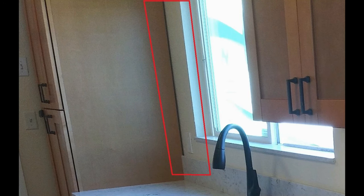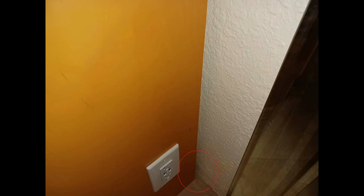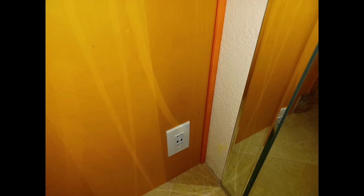Now to address the gaps on the east wall. Since this wall isn't straight and flush, the resulting gaps — which vary from half an inch to three-quarters of an inch wide — need some backing to support the molding strips. So I took some narrow strips of half-inch thick plywood scraps and used hot glue to mount them directly on the wall just below the surface of the cabinet edges. Then the molding strips were cut to length and held in place with hot glue as well. A big advantage of hot glue is how quickly it sets, so you don't have to hold it in place for very long, and mistakes typically just peel right off. Next came a bead of silicone on the bottom front edge of the cabinets, followed by cutting some veneering strips to length and using liquid nails construction adhesive to glue and mount them on the bottoms of the cabinets.